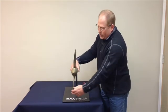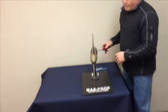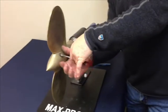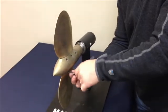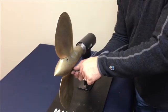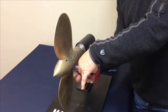At that point, bring the prop back to the feathered position with the seam between the two halves vertical, that way as you take things apart, things won't fall apart on you. Take off five of the six screws — that's the first step. Don't take off all six. Take off five and give it a pause, because once you get the sixth one out, things can start falling apart on you if you're not careful.